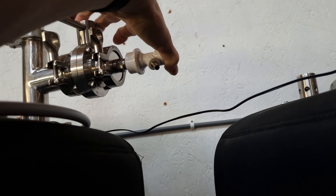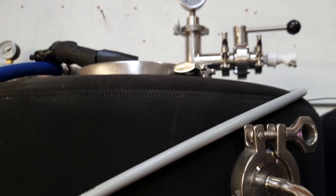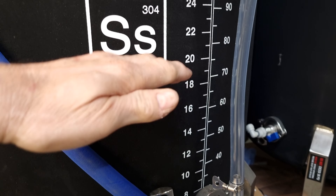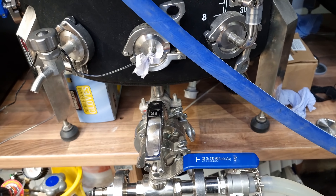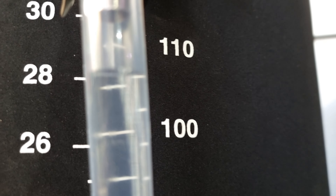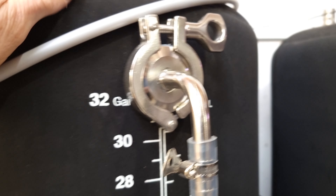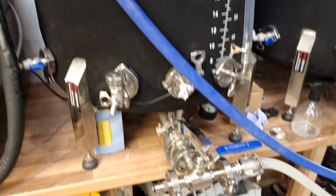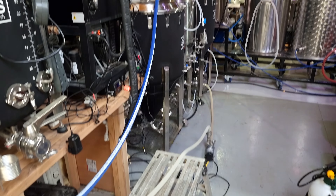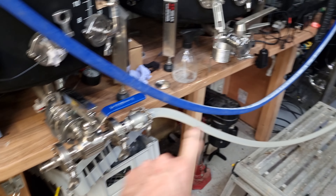What I'm going to do is release at the top - I'm going to put a ball lock on there and just allow that to vent off if there is any liquid going in, so it doesn't have too much top pressure on it. We've topped the 100-litre mark, which is good. When it's filled, I'm then going to take off here through the bigger pump and run the spray ball to make sure we've got everything inside, and then run it back into that fermenter.